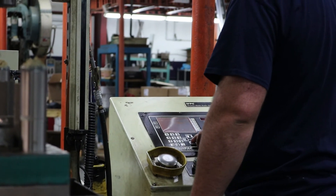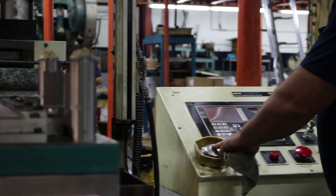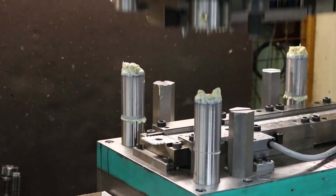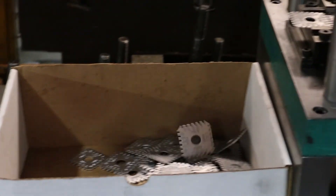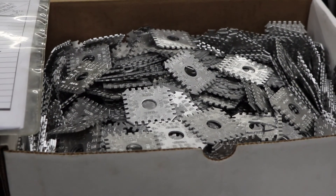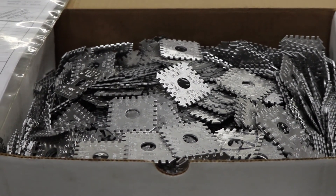Jenison designs specific tooling that can capture both mils and microns on opposite sides of each head. The coiled aluminum material is run through the progressive die, completing a different operation with each strike of the press — starting with the mils and microns designation and finishing up with the outside profile and overall shape.